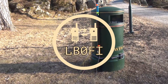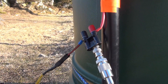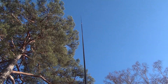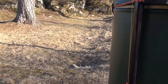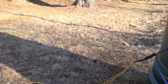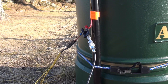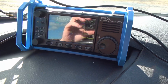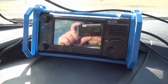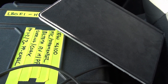I'm using the same garbage can as I usually do — it's just so easy to strap the mast here. I got the binding post adapter here. Up the mast is about five meters, a quarter wave on 20 with solid wire going up there. Out here are eight five-meter radials just laying on the ground. The mast is a six-meter, simpler, cheaper mast, but six meters is great for such a short antenna. Today's station in bright sunlight is the X6100 as usual, but I'm going to try something different today — logging with my Microsoft Surface Go and the keyboard.